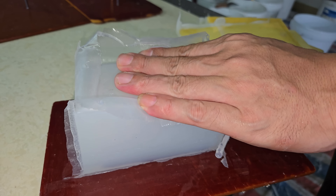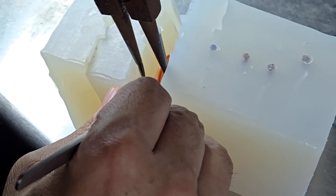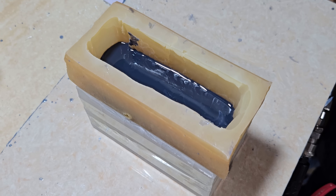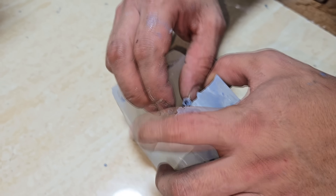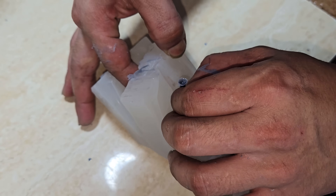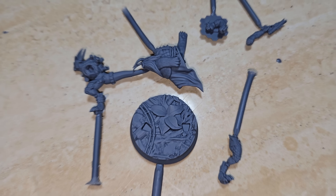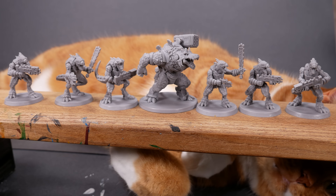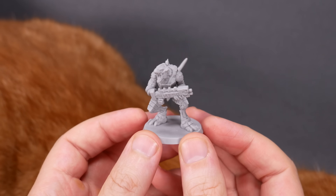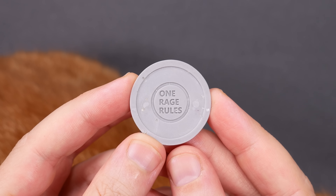After the silicone has cured for about 24 hours, a scalpel is used to cut down the center line for each bit to remove the originals — the red marker guides these cuts. Once the 3D printed masters are out, two-part casting resin is mixed and poured into the mold. When cured, the bits created are the second generation resin masters. One set can be used in the next step of mold making, and another is sent to the client for approval. Some resin masters were even sent to me for this video. OnePageRules did catch an error — a typo reading "OneRageRules" — and got it fixed before it was too late.